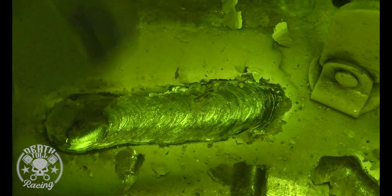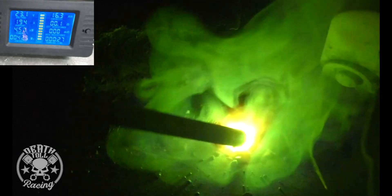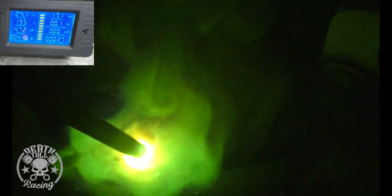I'm amazed that works. It didn't vaporize the rod, so I'm not sure we're getting a full 220A — let's hook a gauge to it. With the gauge hooked up, at the beginning it was reading 71.8 volts open circuit, which is pretty good and makes starting the weld really easy. The amps column is showing 195–198A while running. It reads a little on the low side but I don't believe I'm exceeding 210A — that's the max for this rod — and it's running it very well on the hot side. I tried to stall the welder out and it wouldn't, and I was actually afraid I was going to weld the plate to my table.